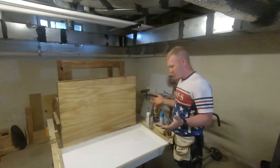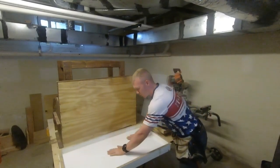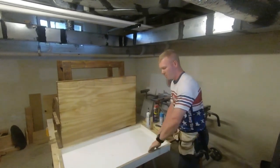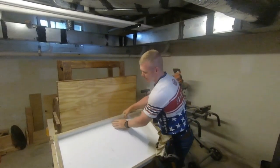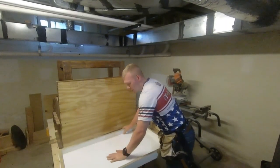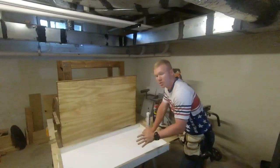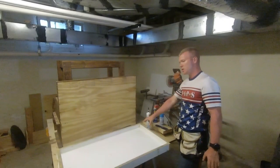The method I went with: I measured out exactly how big I wanted the countertop to be and made a mold. This is melamine — it's plywood in the middle with a nice plastic, usually white, outer layer, which does not stick to concrete or most other things. I made my mold about an inch and three quarters thick, 36 inches long, and about 20 inches wide.